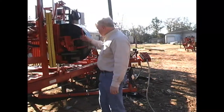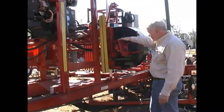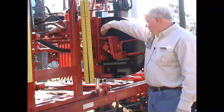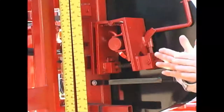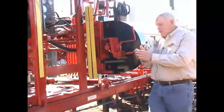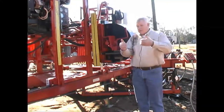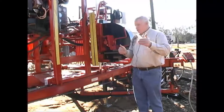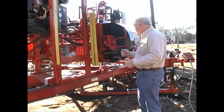From this angle we're going to show you quite a few things. We're moving to the tension side, which is the idle side - we've got the idle shaft in here. Starting up at the top with the vertical hinge: this hinge has a pin that goes down and opens and closes. If we open the hinge, the band is going to run forward toward the log; if we close the hinge, the band is going to run back toward the operator side or back toward the guides.